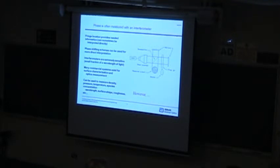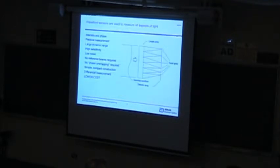So there's other techniques, and the other technique that is one of my favorites is the Shack-Hartmann sensor. And so the Shack-Hartmann sensor is a very simple kind of optical concept. It's just a lenslet array in front of a detector. And the lenslet array dissects the incoming light, the wavefront of that incoming light, up into a series of small focal spots. And the position of those focal spots has information of the direction the light is traveling at each point. And you know, I joke the only physics behind the Shack-Hartmann sensor is that light travels in a straight line. It's just connect the dot from the center of the lenslet to where you found that focal spot, and really you've got the main information.